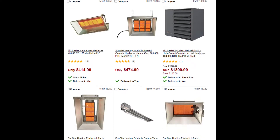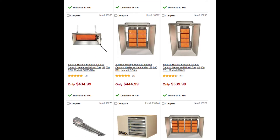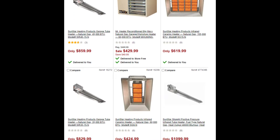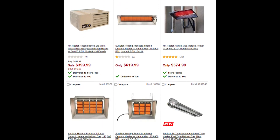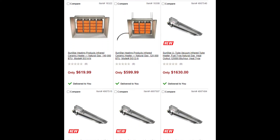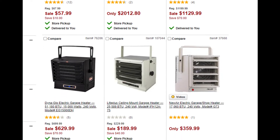Next up is natural gas — this is the top-of-the-line solution, it's what most home furnaces use. It is also the most costly to purchase and install because you need a gas line, and if it needs electricity, its own electric circuit. And again, because you're burning gas, it also needs to be vented to the outside.